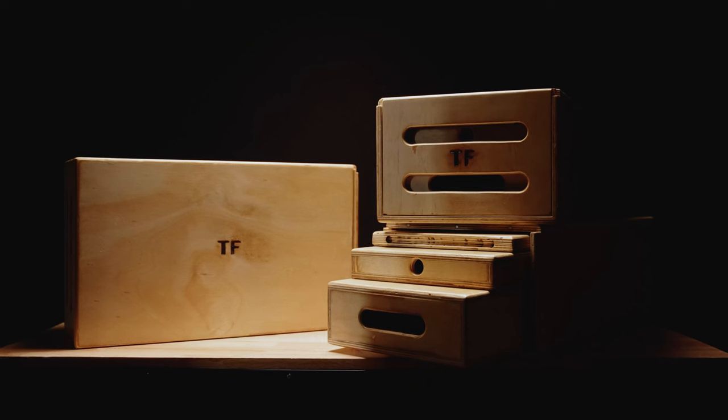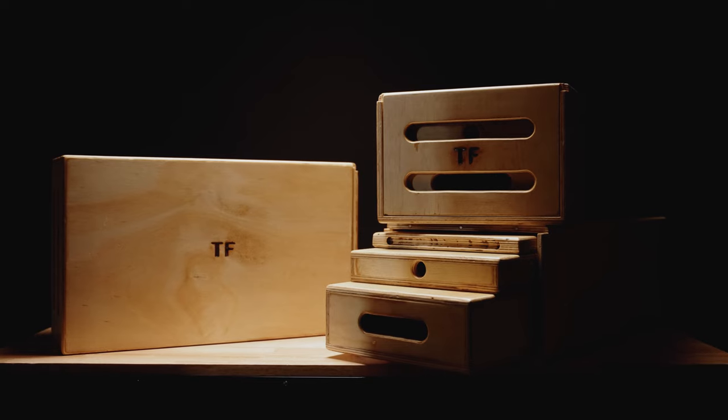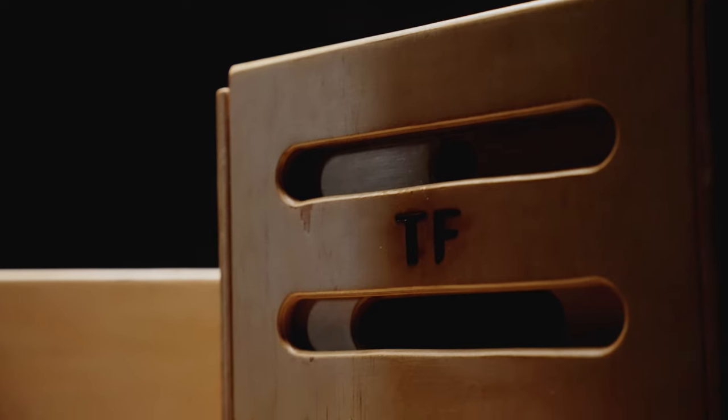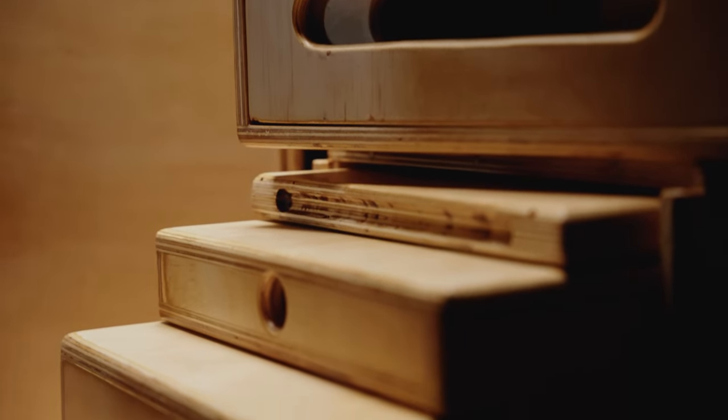For the finishing process, I sanded all the faces to 220 grit. I was able to start with a finishing sandpaper, as the material was already pre-finished and sanded. After sanding, I cleaned all the surfaces and finished with three coats of oil-based satin varnish, sanding in between applications. You can use any durable finish of your choice — I just wanted something that would last and hold up to the abuse.